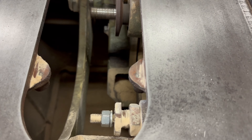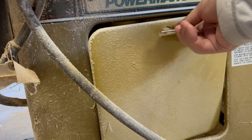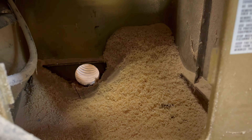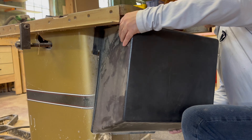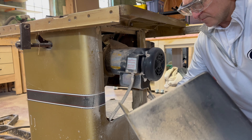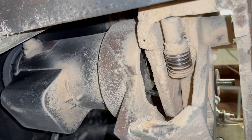As you can see, there's quite an accumulation of sawdust inside the saw. Clearly the dust collection on these older table saws isn't very good. If left unchecked, too much sawdust could cause motor failures by overheating the motor. Caked up and accumulated sawdust can also negatively impact your saw's performance.